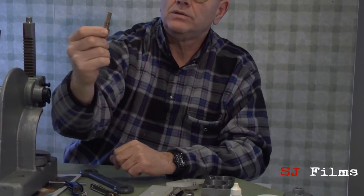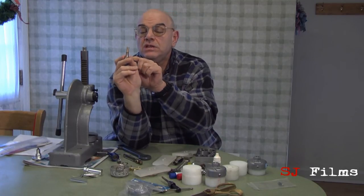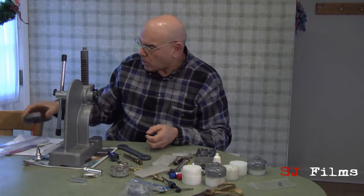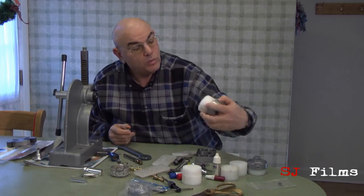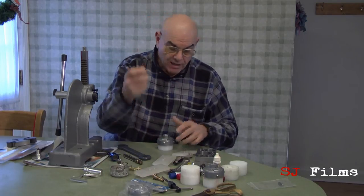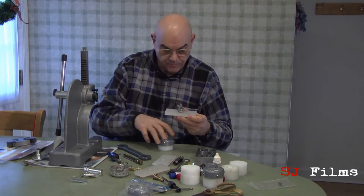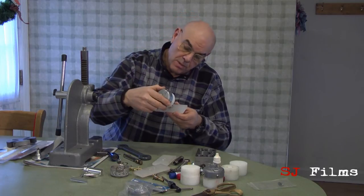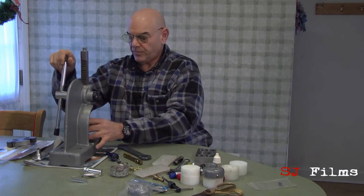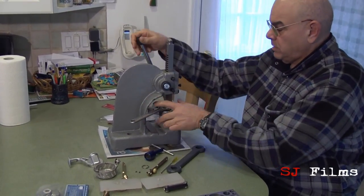This one's out of a 200 series and you can see the threads on the shaft — this is known as a sleeve guide and you can actually see the stainless collar that's the sleeve. So what we're going to do is remove that pinion, which requires a homemade tool, which is really what we're trying to show you today. This is the one for the 150 size. We're going to mount this in what I refer to as an immobilizer, which is keyed to the assembly, and take this homemade tool and place it down over the sleeve guide to fit into a press. Once everything is mounted it's just a simple matter of giving about a quarter turn — that'll loosen up the pinion.